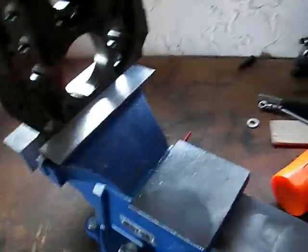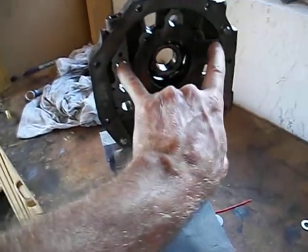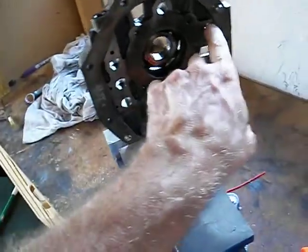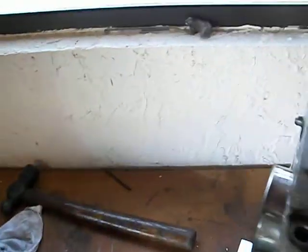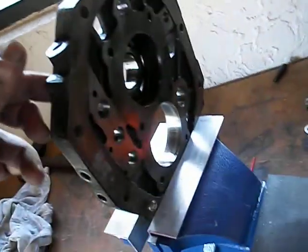All this came out. I tried the hammer on it the way they show in the FSM but that didn't seem to work out so well. So I just used the puller — the same one I used to pull the main shaft. I think I used these two holes here: one's a shift fork hole and the other one is the oil gutter hole. I just pushed it out from this direction.